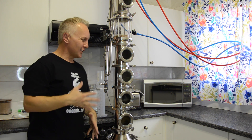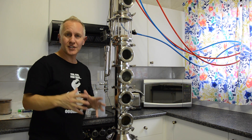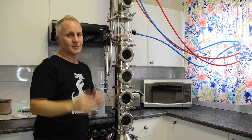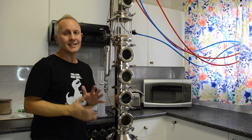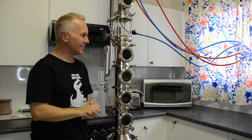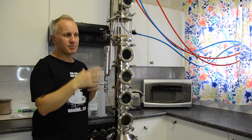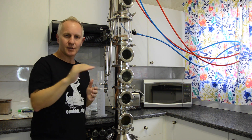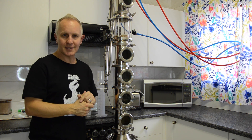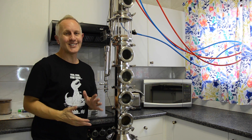What an eventful day! I played around and did my high reflux run. I actually got six liters out at an average of 94% alcohol — I'm very happy with that. It shows my still is running very effectively and all my plates are doing an excellent job. I also worked out about a 99% recovery rate from whatever was in the boiler to what I got out. I stopped it when it dropped to 90% ABV because I didn't want to start contaminating it — I wanted to keep it as pure as I could. I also played around with flooding to see how it works and how to subside it — be on the lookout for that video. Thank you very much for viewing, and as always remember to be awesome, be kind, and be yourself. Cheers!